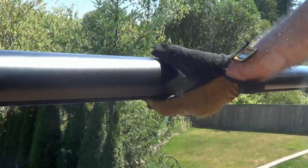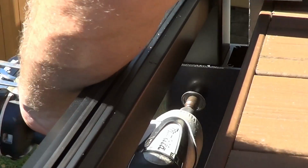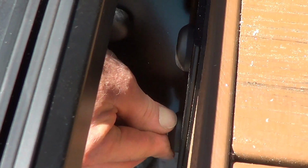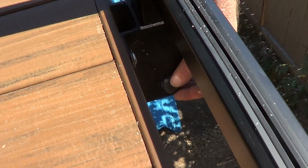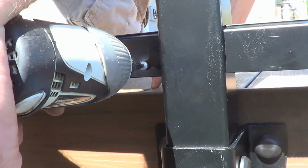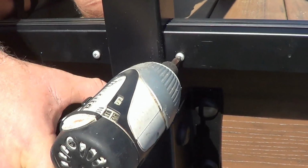The top rail glass infill snaps into the underside of the top rail. Use the provided self-drilling number 14 screws and washers to secure the posts to the fascia bracket. Don't forget to install the color-matched button caps. Secure the bottom rails by installing the self-drilling screws on the outside surface of each end of the rails.